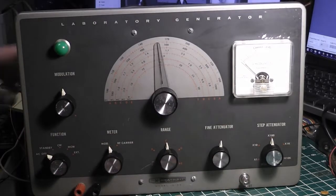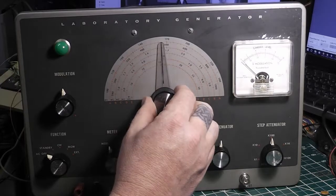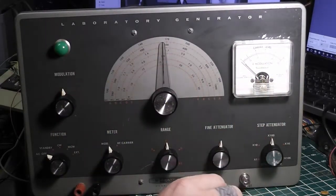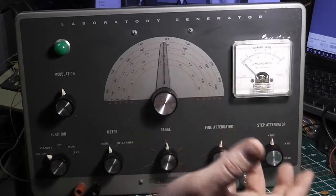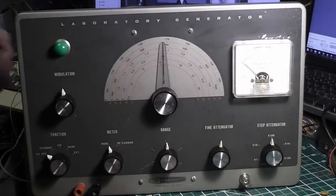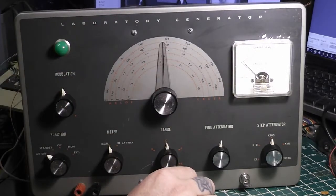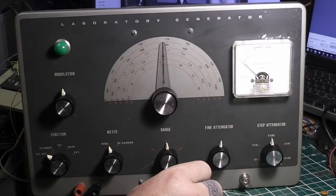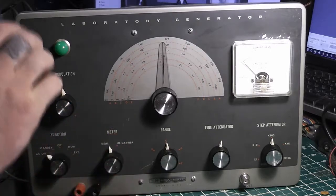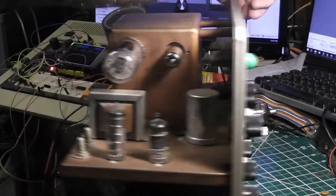For alignment, I think I mentioned that capacitor in the back — if you set it to, say, five megahertz on the dial and it's not showing five megahertz on the frequency counter, you have to rotate the dial slightly to get there. I went back, looked it up, and turned the trimmer through that little hole in the shielding until the dial lined up accurately. There's not really a whole lot of adjustment available on this particular model for a full alignment.